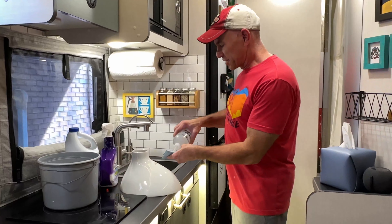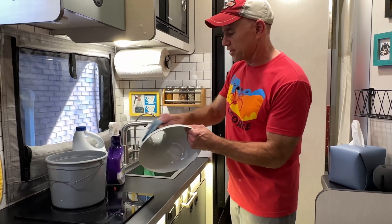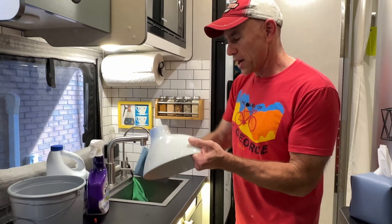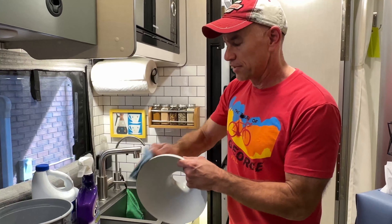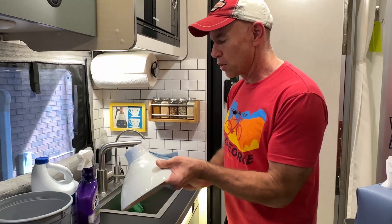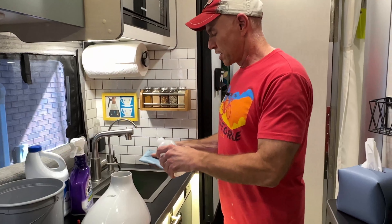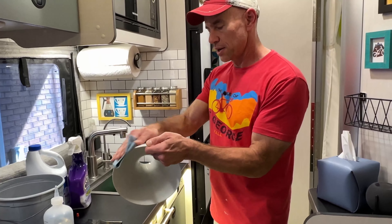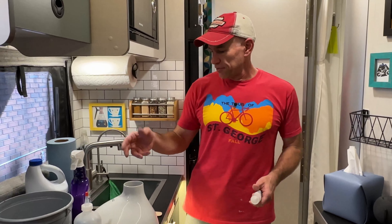Next, we're going to take it out and give everything a final wipe down with denatured alcohol. Then it's just drop it in and silicone it in place — the install is really easy. It's really important to get these really clean because once you install them they're going to be sealed away and you won't have an opportunity again, so you don't want anything sealed in there that's not clean or that might get rancid or smelly over time. So I'm cleaning the outside surface of the bowl and giving it a final wipe with denatured alcohol, then doing the same to the inside of the toilet.